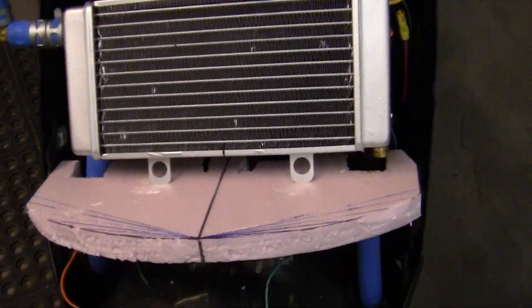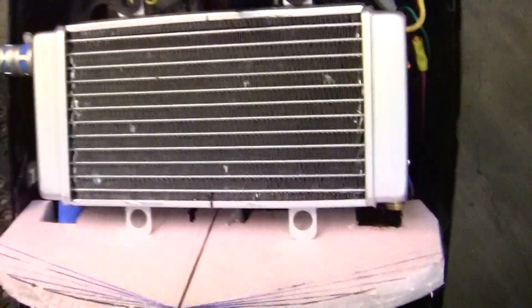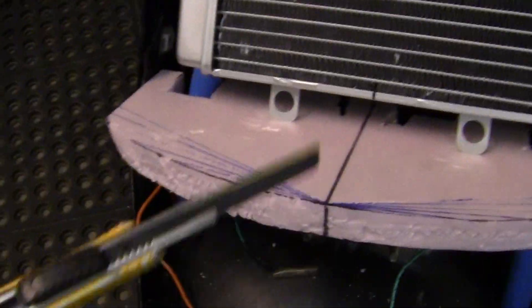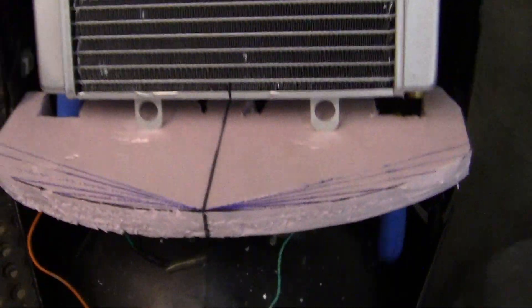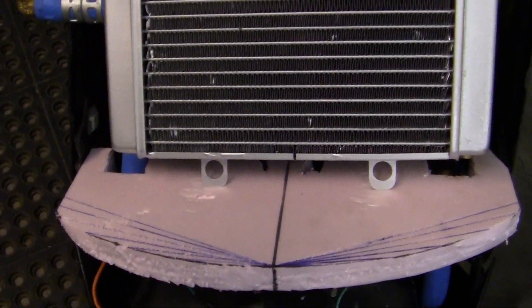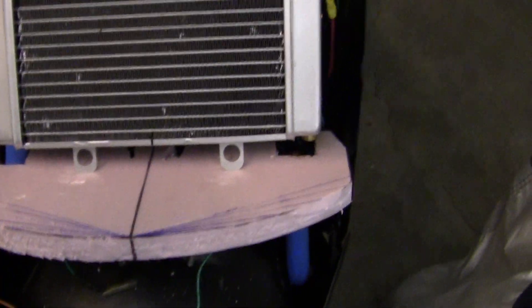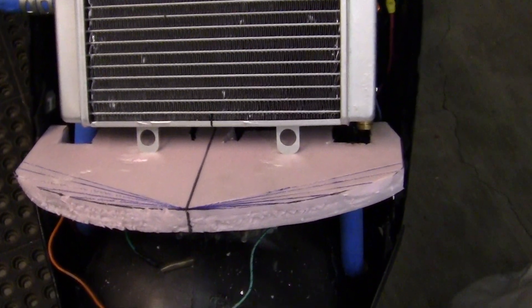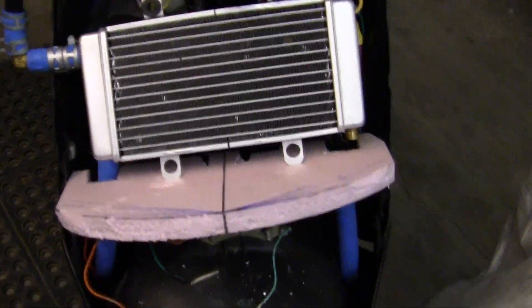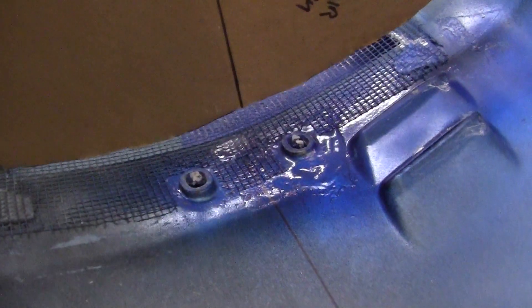You don't have to be perfect about this, because you can take a little bit of sandpaper or an X-Acto knife. This stuff cuts with an X-Acto knife and can be sanded too. It's nice — it's waterproof, it's hard, it's a good subsurface, and you can mold it. You don't have to spend a lot of time doing it. Once you get your pattern, this is the top air dam or bottom air dam pattern, which goes right here.